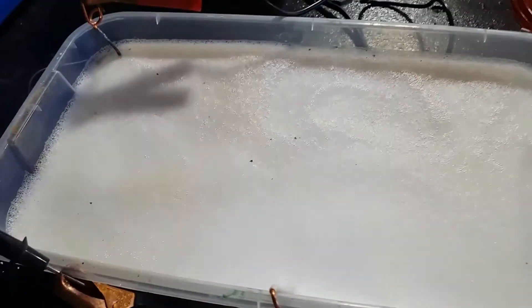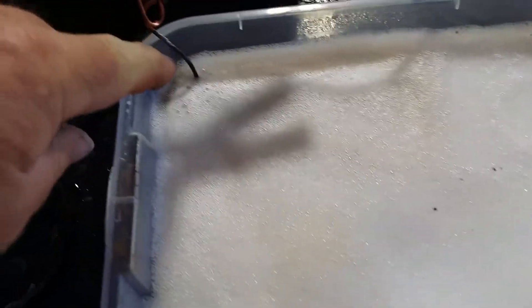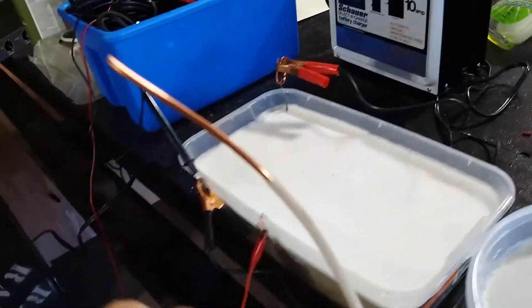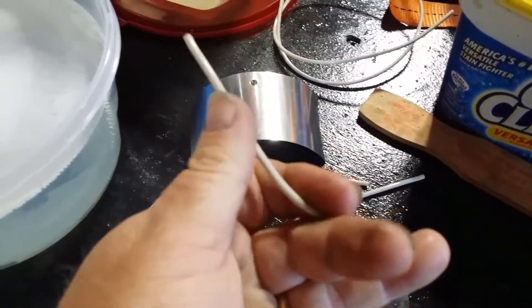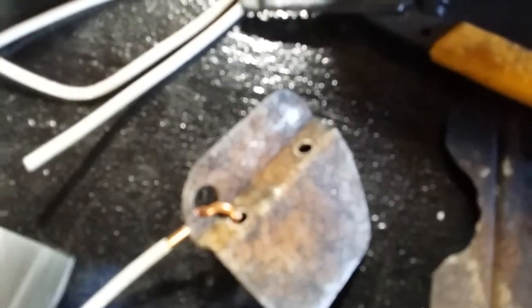You need a sacrificial anode. I used a four-inch square electrical outlet box — I just had it laying around. I attached a short piece of copper wire to it. Here's the other butterfly we haven't put in the tank yet — you can see how gross it is after a week in the carburetor tank. You attach a copper wire; I'm using 12-gauge solid copper wire stripped from some old Romex. Solid wire bends and holds its shape, which is convenient.